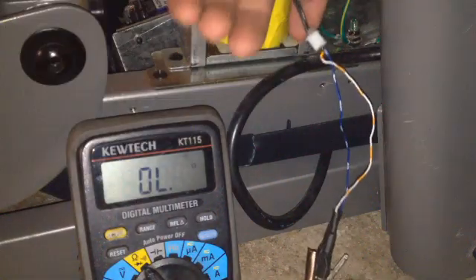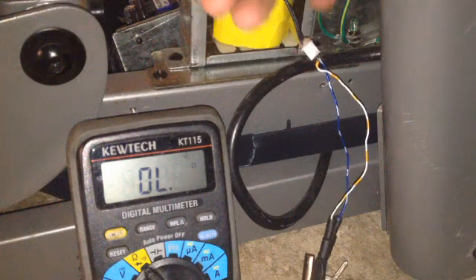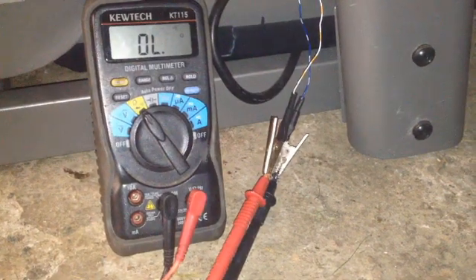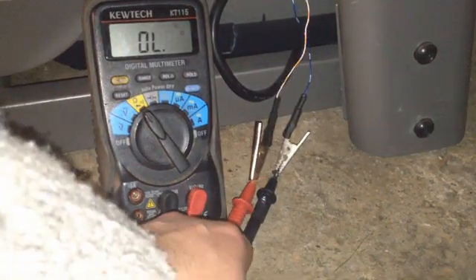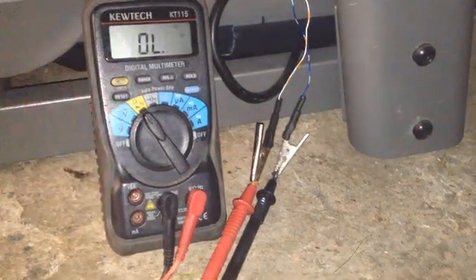In this section I'm going to test the reed switch, so I've just pulled the connection from the board and hooked it up to my multimeter. I've got two wires going to crocodile clips which are connected to my two probes, and I have the multimeter set to continuity, as you can see here.